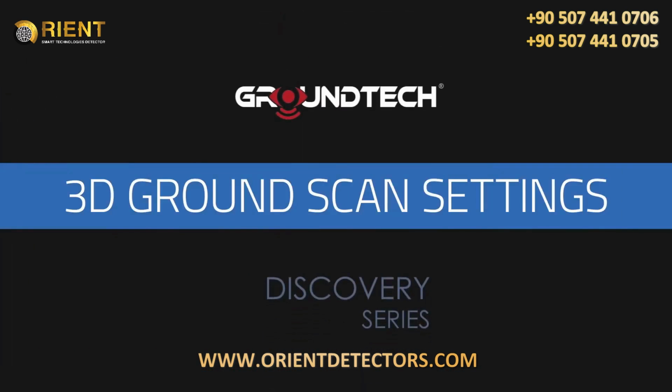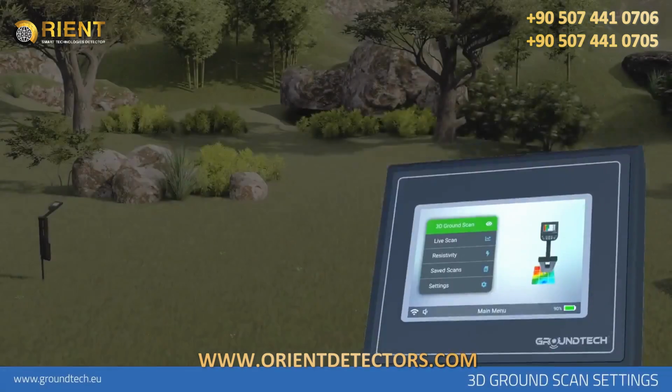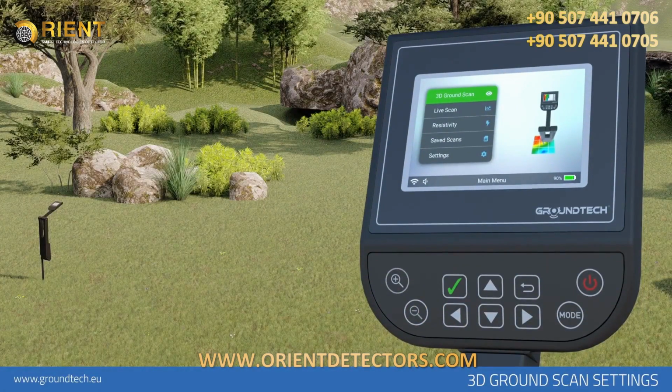3D ground scan settings. 3D ground scanning allows you to create 3D graphs based on whether you can scan a specific area. There are two options in the ground scanning function, automatic and manual. You do not need to press any button in automatic scanning for each number of signal pulses entered, and you need to press the start button for each signal in manual scanning. Auto scan and pre-scan settings in manual scan.